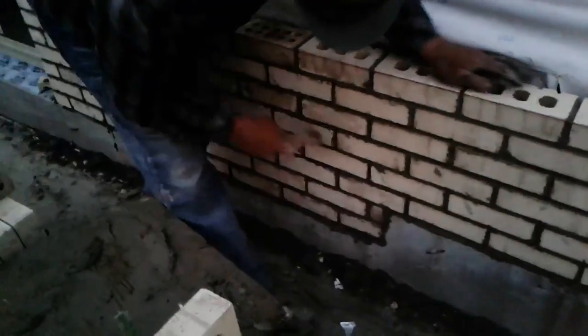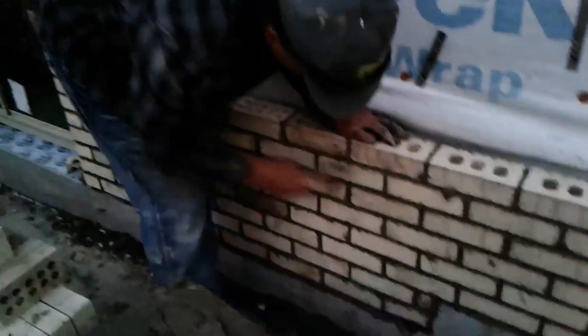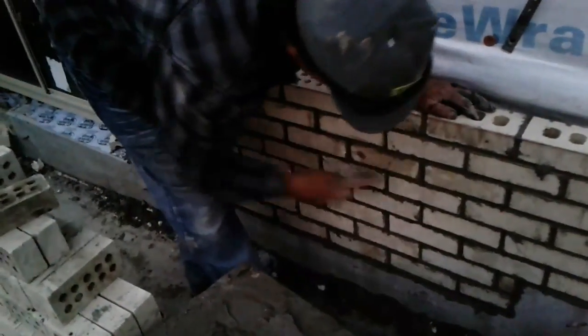It's not as far back as they went. This house is probably built 40 years ago, something like that. Rake joint — I just don't believe in it. It takes too damn long, and it's not sufficient waterproofing. It doesn't make for a good solid wall when you take about a half inch of that mud out of the front of it.